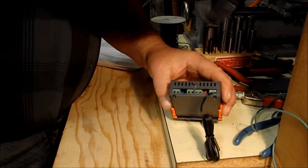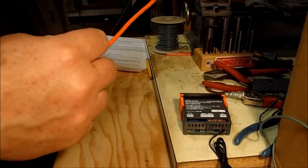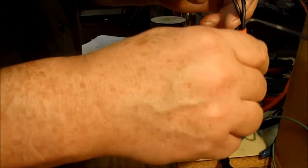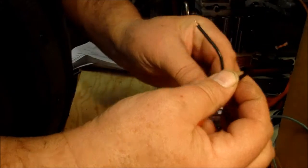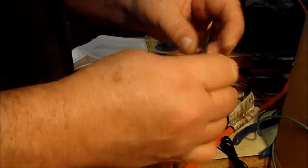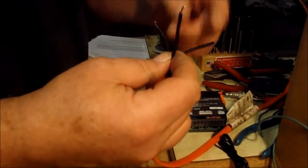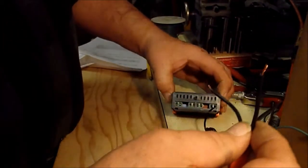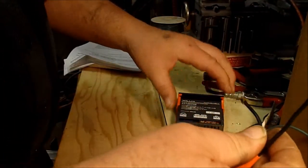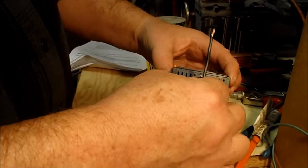Here's a cable salvaged off heat tape — it has a common and power wire. There's no ground terminal on this controller; no pass-through or facility for ground at all. If you're using this with a heater or air conditioner you'd want to hook the ground lead into that device, but just set it aside for now.